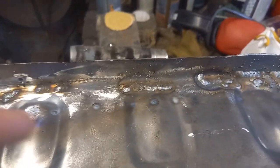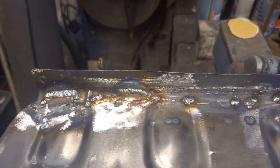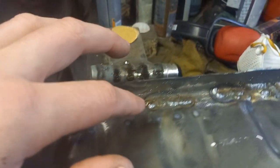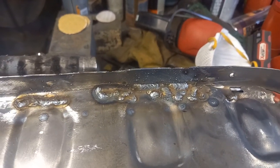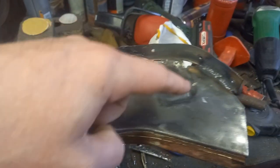Here's the next lot of welding — you can see it starting to build up. Now, rightly or wrongly, I kind of view my welder as a bit like a 3D metal printer. Where you've got gaps and where you've got holes, you can use the weld just to build it up and then grind back. Like I said, rightly or wrongly, but it works for me. And that mindset has kind of altered the way I weld things. I'm going to grind this back now and see where we're at, and then perhaps start making a start on this area here.